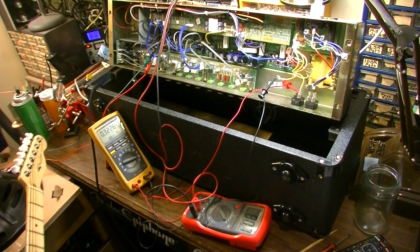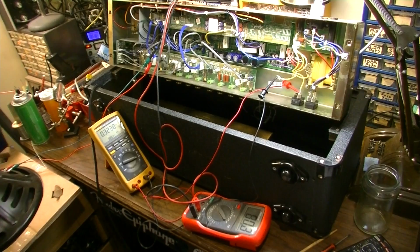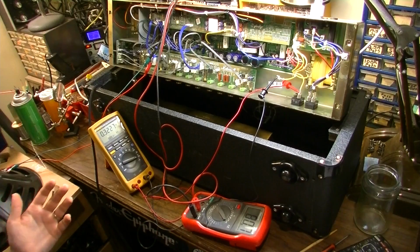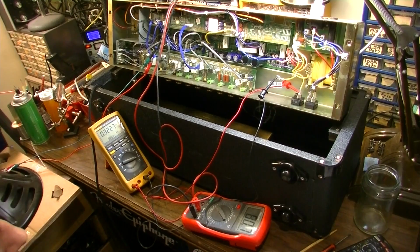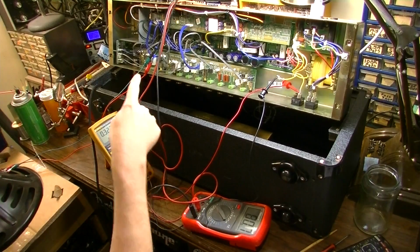So my theory is what probably happened was that when I turned it up a little bit while I was playing around with it last time, one of these connectors, because I've only got gator clips on this speaker, and there's gator clips here as well, perhaps one of the gator clips that's hooked up to my load jostled a bit and momentarily disconnected, which the amp saw as a no load situation. And under a no load situation, yes, the high tension fuse would blow. My guess is that's what happened whenever that fuse blew. Basically, it's like having a bad cord. Momentarily there was no connection.